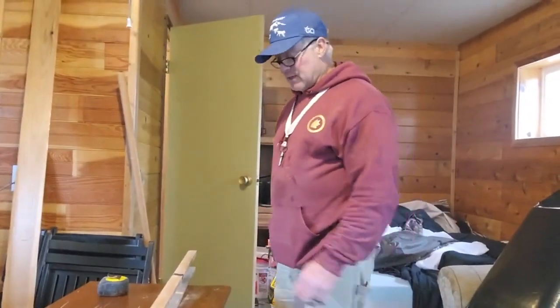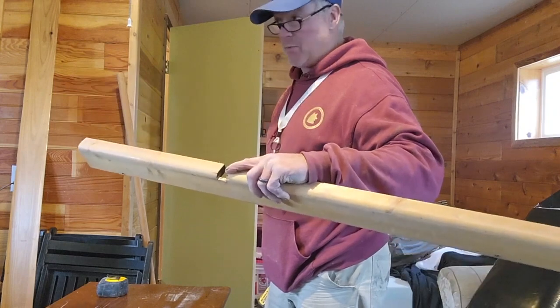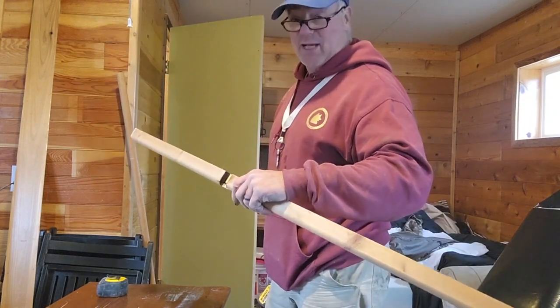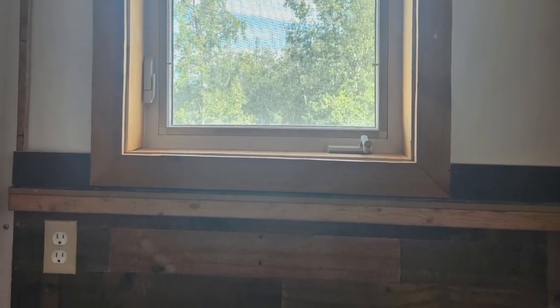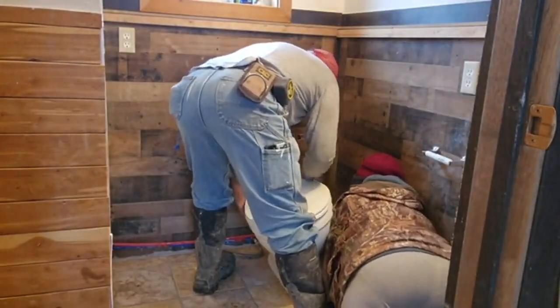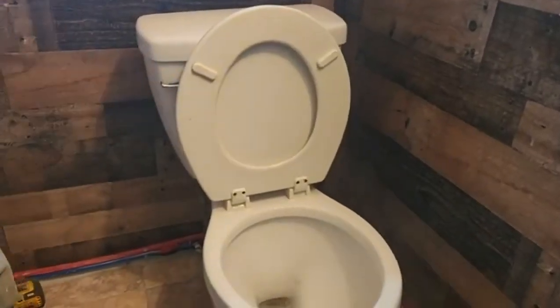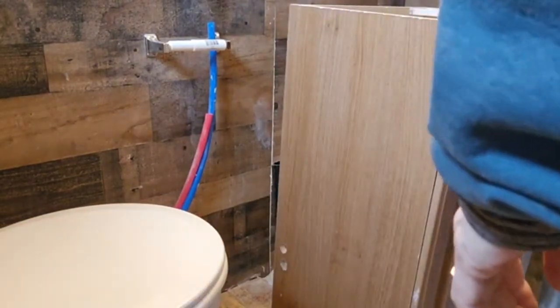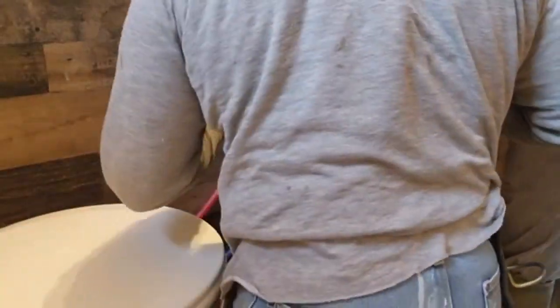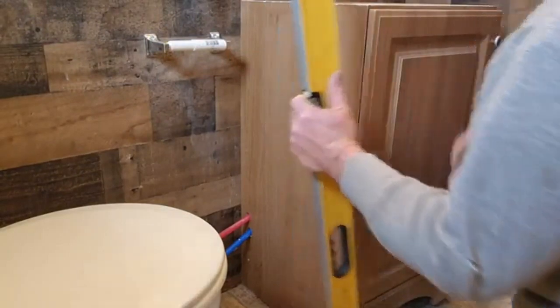Okay folks, we're back at this modification where I dadoed it. I got this notch, but it's not quite enough. It's a half inch pipe, but the OD is probably somewhere around 3/4, and I've got just over a half inch, probably about 5/8, so it has to go deeper. So we're going to notch a little bit more. Close enough, ain't it? Check it this way, hold on.